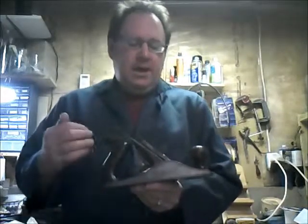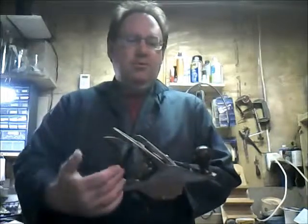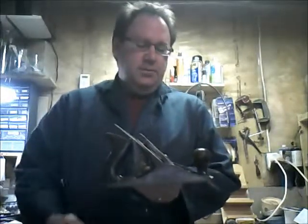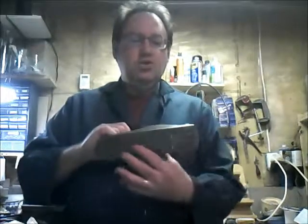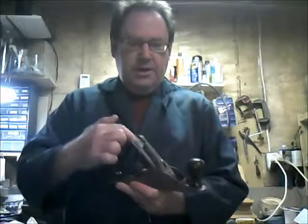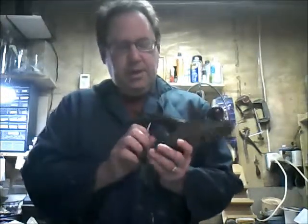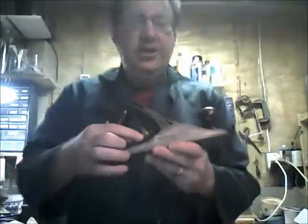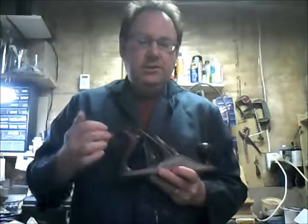When we look at a plane, there's a whole bunch of different parts. I don't require students to know all of the parts, but there are a few key ones to know. The plane almost looks like a boot — the front is the toe, the back is the heel, and the bottom is known as the sole or the base. We have this front thing that looks almost like a trailer hitch — that's a knob. The part you hold on to is called the handle. The blade is called the plane iron, or more simply the blade. The big opening down here is the mouth. There's a brass-colored wheel called the adjusting nut, and that little lever that slides from side to side is called the adjusting lever. These are the two key ones you need to know and know how to adjust.